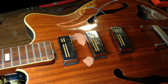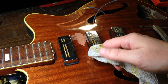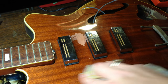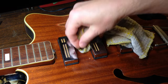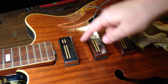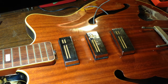The wood filler is for the most part dry now. What we're going to do is just take a damp cloth and rub most of this away — that's the cool thing about this stuff. I don't really have to sand all this; I can basically just rub it away with a damp cloth and leave the bit that I want to leave. Voila — there are our holes filled. I'm gonna get a little bit of finish in here just so if somebody's polishing their guitar they can't scoop all of that material out on accident. Just a couple of dabs of finish and we'll be done with that part.